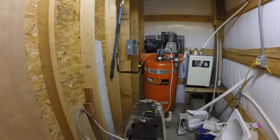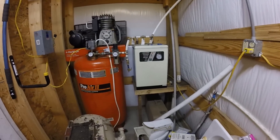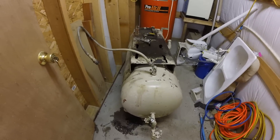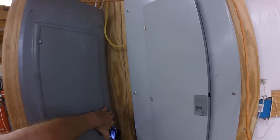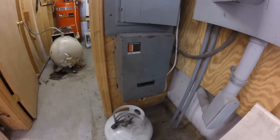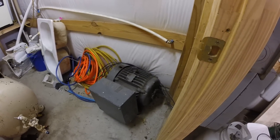This is my compressor room — that's where I keep my compressor, and I have an air dryer, a Harbor Freight air dryer that's probably the best deal on air dryers you'll ever find. They don't sell it in stores but it's available online. There's also a spare air tank I need to test. This here is my three-phase converter made from a 15-horsepower motor with a bunch of capacitors, my 220 box, my three-phase panel box, and the control panel for the converter.